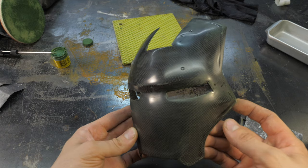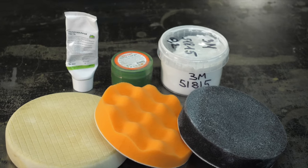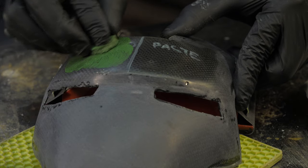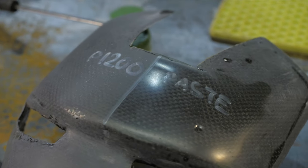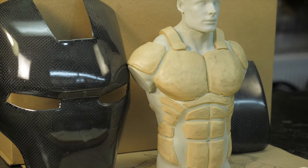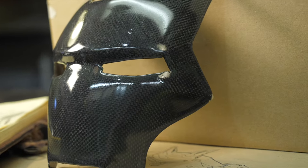After finishing sanding, proceed to polishing the surface. Use a soft microfiber cloth, foam rubber, and polish paste. It is better not to polish with green polishing paste for metal, unless you want to make a green goblin suit — green paste gets embedded into the micropores of the coating and the surface will appear green in bright light. For coatings of different hardness you need to choose the appropriate polish; epoxy is well suited for polishing paste and disk designed for car polish.